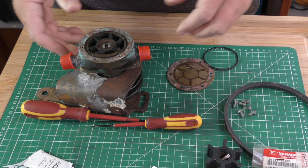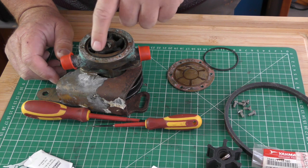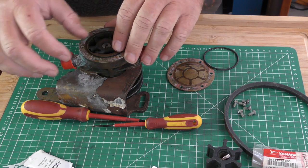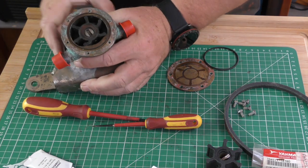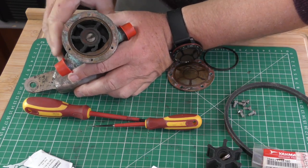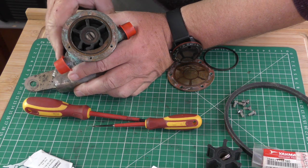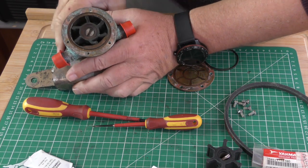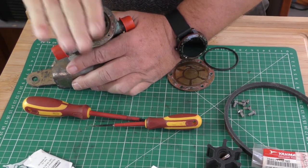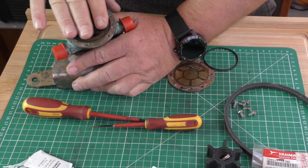Now, you hear lots, or you see lots of waffle about those impeller lobes being the right way around, okay, because of the rotation. You note that when I turn this wheel, in whichever direction I turn it, those lobes have the room to crush and go the right way around. And if I turn it the other way, there it goes. And it's only going to affect one lobe when that pump first starts up. And there's lots of glycerine in there, so you're not going to damage the impeller lobes.